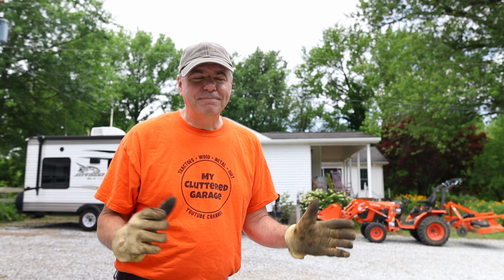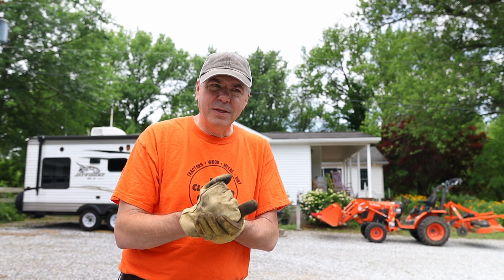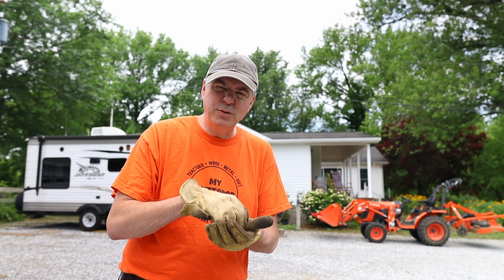So my concern is, I don't really have a concern, but the one thing that I would watch for is that I wouldn't want to bow the front of my bucket. You have all that pressure just on that area where you put that screw in, that clamp that clamped down. So you're depending on the strength of the bottom of that bucket. So you're putting all that into one kind of pressure point. I don't like that so much, but I also don't think that it's going to be that heavy for it. Certainly the lift capacity of the tractor can handle it.